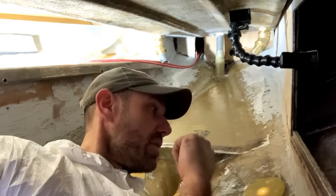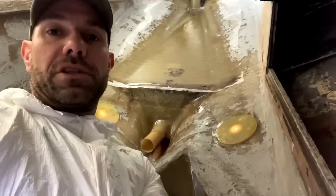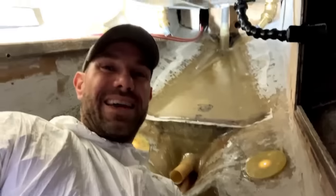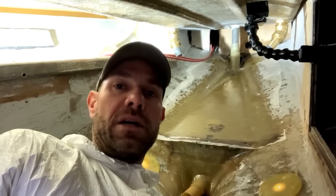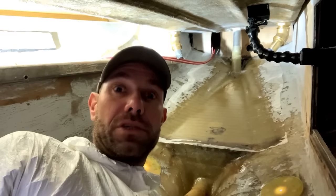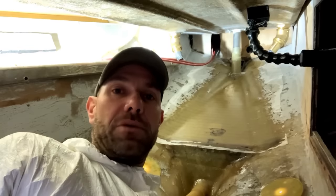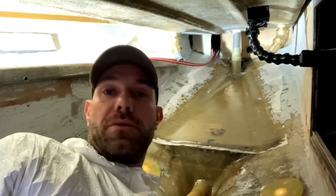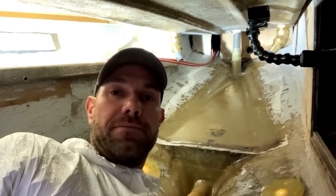And it was the same actually with these little discs that I've put in. So those little discs that I've bonded onto the hull down there for the seacocks, again, I'm pretty sure, I can't remember 100%, but I'm pretty sure that they were cut out of a sheet of epoxy glass layup, and so again they needed to be bonded in either with vinyl ester or epoxy, so I've used epoxy again for the whole lot, and that's why I've chosen to do it the way I have.